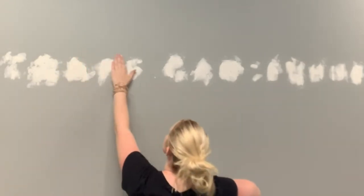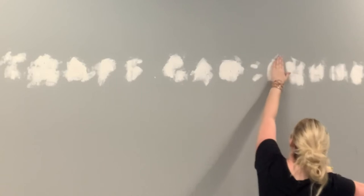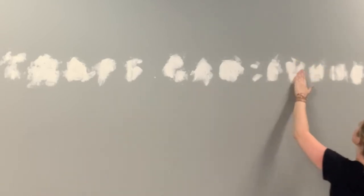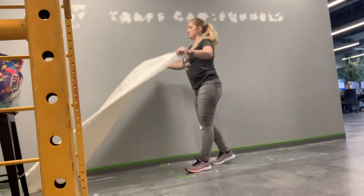Next, prep the wall — make sure everything is sanded, the holes are filled up. If there was a sign previously on the wall, make sure it's all covered and nice and smooth. Make sure the canvas you're working on, which is a wall, is ready to go. Then prep the floors. Especially if you're in a corporate setting, you don't want to get paint on the floors or side walls. Put a clear plastic — it can be a shower curtain — on the ground, tape it down so it stays put and you're not tripping over it. Put a canvas drop cloth on top of that, because the paint is going to seep down and you won't be cleaning up these floor pieces for days, maybe a week or two.